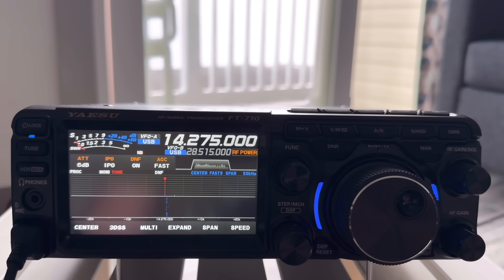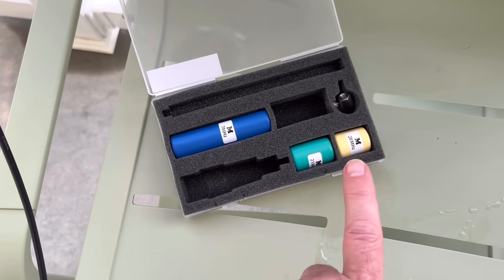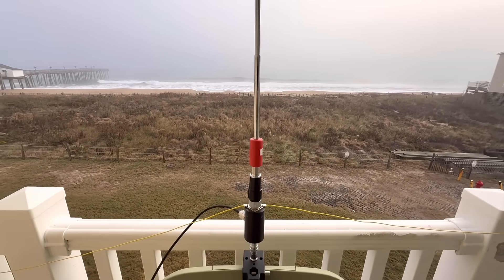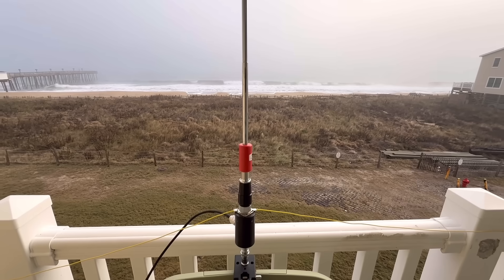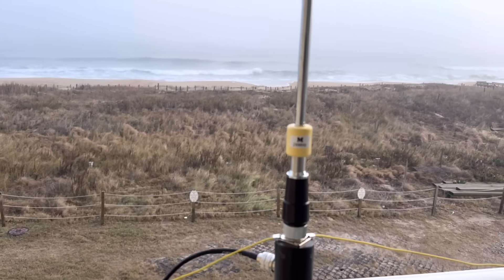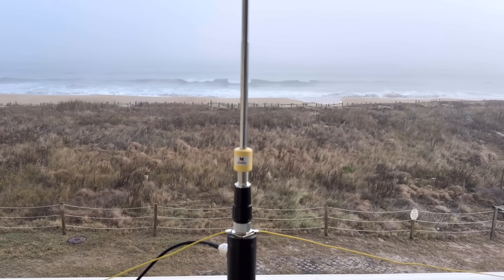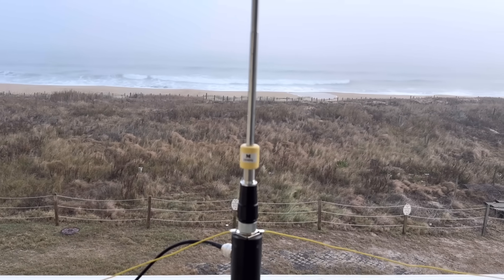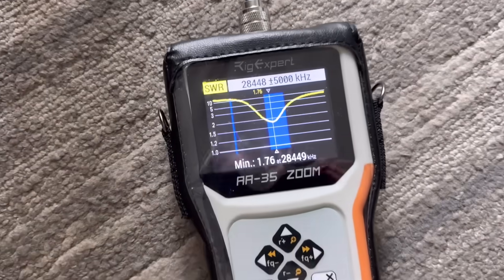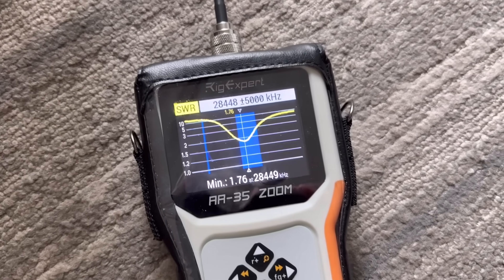Good morning to that lovely young lady you have with you. We see her quite often when you take her out with you, and it's always nice to see her. I'm going to put the 10-meter band on now. We're going to give it a try on 10 meters. I'll take the coil off here — the 20-meter band coil — because that was all I could hear was Bermuda. So let's give 10 a try. Here we go for the 10-meter band. Let's see how much tuning I've got to do to make this thing work on 10 meters. Shorter antenna for 10 anyway. One quick little adjustment, and we're good to go.